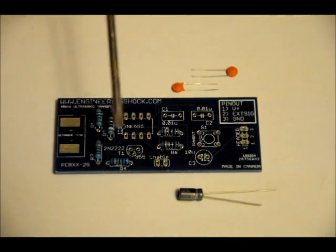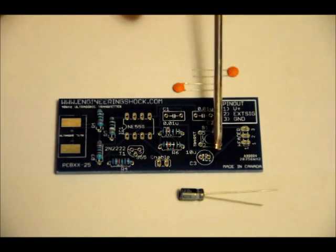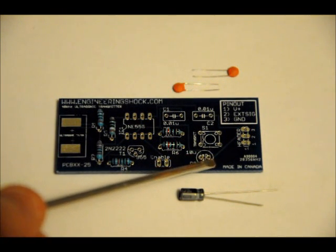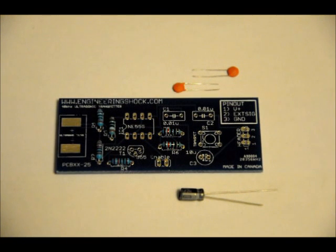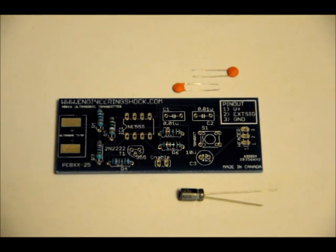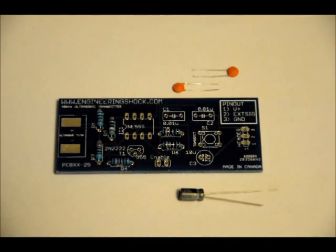C3, from this perspective on the left-hand side, is the negative side, and the right pin is your positive side. You'll notice on the lower right portion of the footprint there's a tiny plus sign. The electrolytic capacitor has two leads: a short and a long. The long lead is positive, the short is negative. Place your long lead in the right hole and your short lead in the left hole of C3. Don't reverse it or your kit won't work properly. Solder those three into place, then we'll do the button and header.